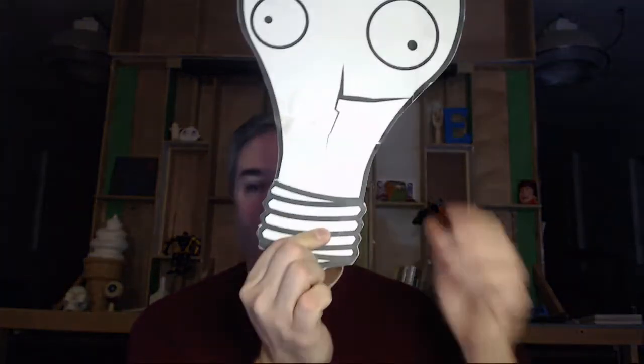So anyway, we're gonna start working today on a puppet mover. In the puppet mover, we're gonna basically take this little doodad here and then move it back and forth. Just a rotation, probably with a pivot point down here at the bottom. There's a little bit of weight to this, and we're just gonna use a metal geared airplane servo to drive it. It should be okay being geared right off of here. I was thinking at first maybe we should make a step down gear right off the bat, and now I'm thinking, let's first just make it work with this gearing and then make a little gearbox to step it down, because I think this rotates 180 degrees. I don't think this thing needs to rotate much more than 90.